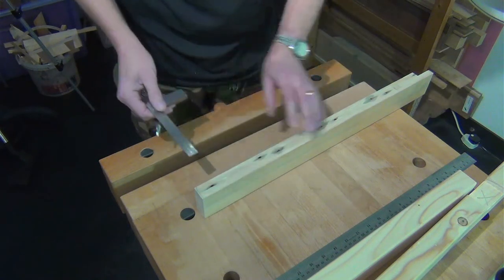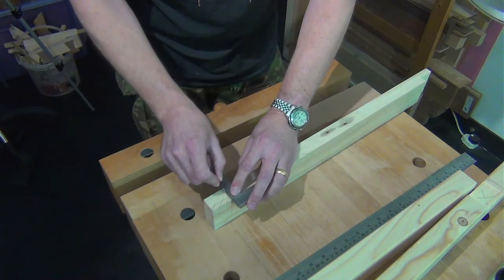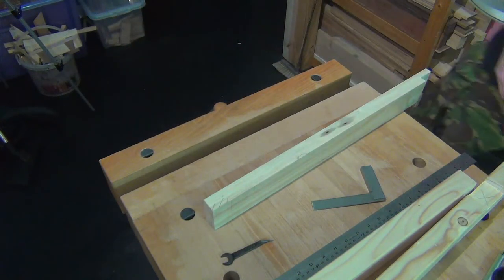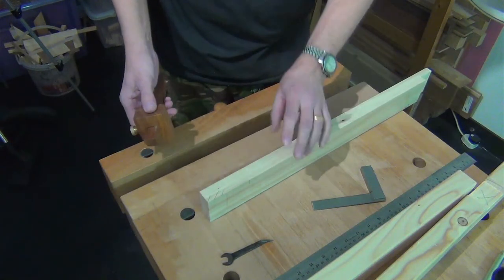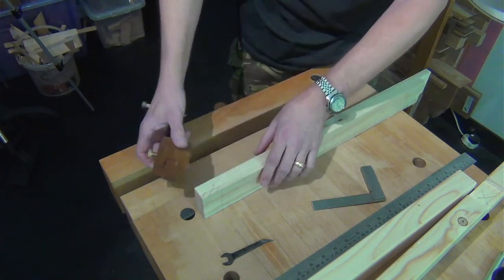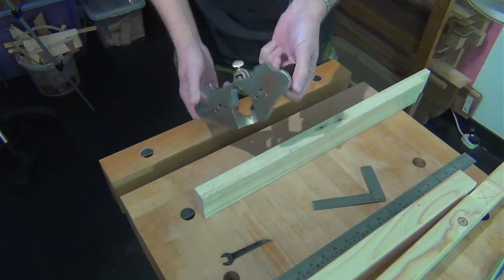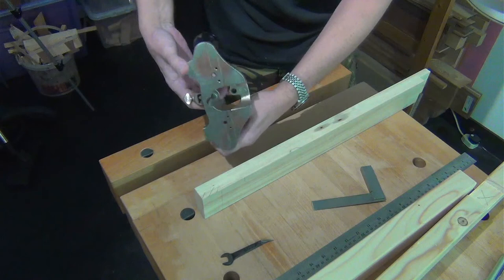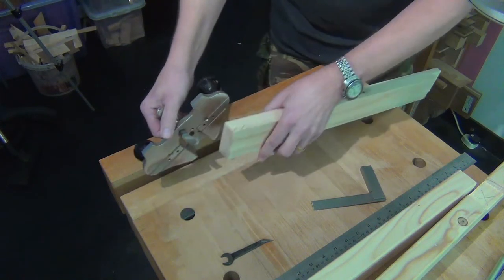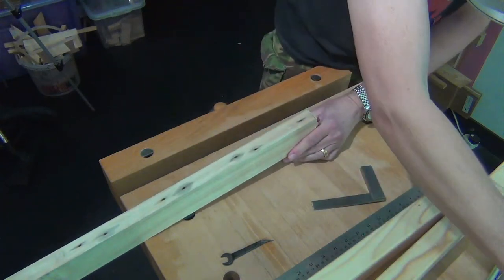You can see this is one of the boards I had to get out of a pallet, so it had a lot of nail holes in it. I squared that line onto the other edge. Normally you'd use something like a marking gauge to mark the depth of cut, and you always do that from the show side, so you know how much material is going to be set into the legs. I'll set the pin up and scribe like so. But when I actually clean this joint out, I'm lucky enough to have a router plane, so I've set that up for the right dimension and I'll just use that as my gauge. So that's being scribed across, also on the end and on the reverse side — that's marked out the whole of the cut I need to make.